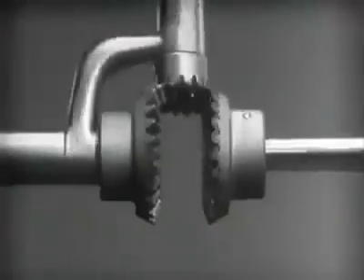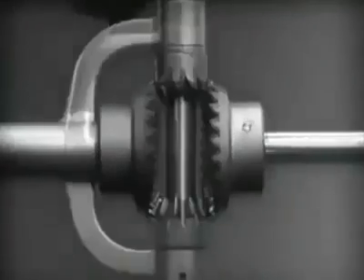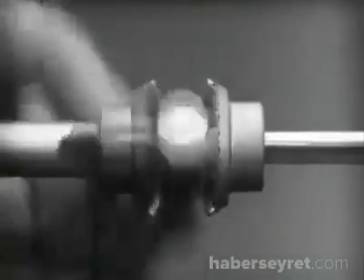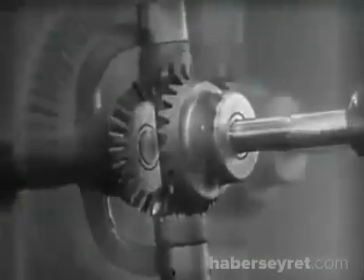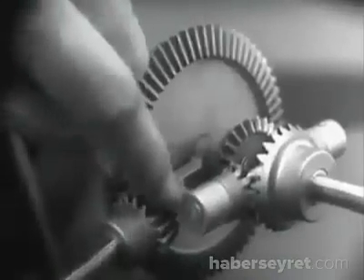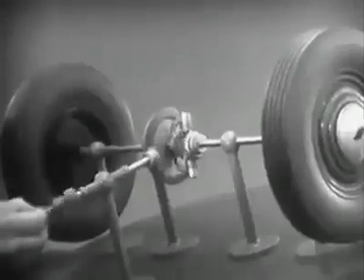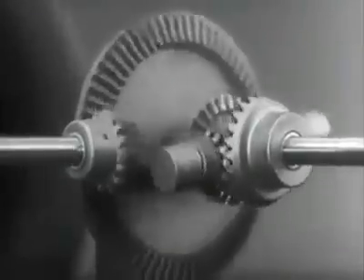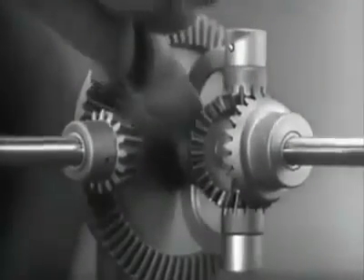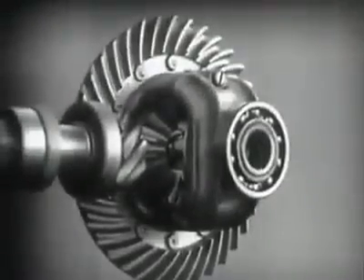The edges are cut so that they will fit together more smoothly and silently. And, another gear is added to share the work of driving the axles. The principle is the same. In order to turn the support and drive the wheels, we can fasten a large gear here, connected by a smaller gear to a source of power. Notice that the power is connected to the differential at the center line. We can make our model more compact by moving the gears closer together.